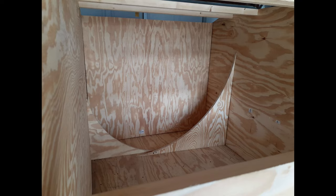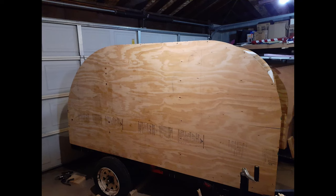This is the point where the footage ends — unfortunately it stopped while I was cutting. A little tip for you: use your cutoffs that came off the plywood after you cut your radiuses to keep your walls square until you can get your spars in place. Here you can see the wall installed. The next video is going to be about the spars and getting them installed. Thanks for hanging out with me — make sure you come back next week. Until then, build on.